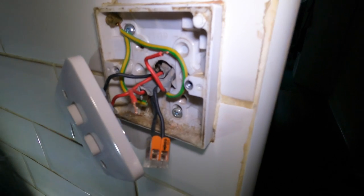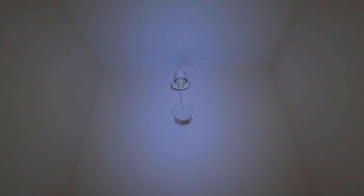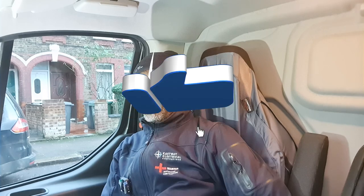This one here — I don't know what it is. I was thinking it would be another live but it's not, so I'll have to look into it a bit more. We put that fitting up — the bulb is flickering. That one's working there but when you put the lamp in it's flickering — I'll have to look into that later. The fault with the switch — I should have sorted that a lot quicker. It's only live and neutral going up to the switch. My Fluke tester — the one I use for continuity — I think that's playing up.